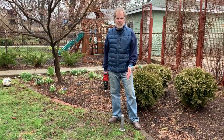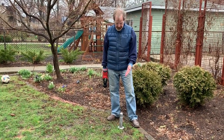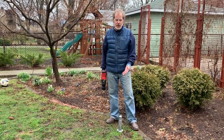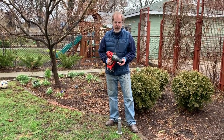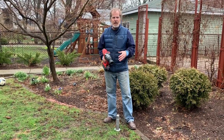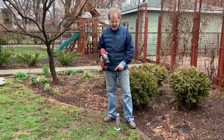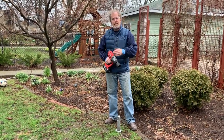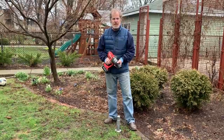I'm now at the location where I've already buried a 42-inch earth anchor. Again, these are reusable. I'm going to start taking this out with a power impact drill, take it out a bit until I can remove it with a wrench, and then we're going to relocate it to the other side of the tracker sled.